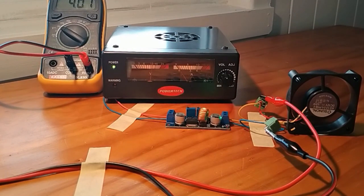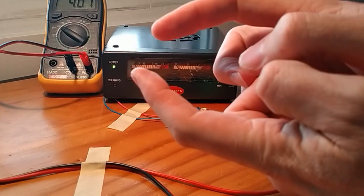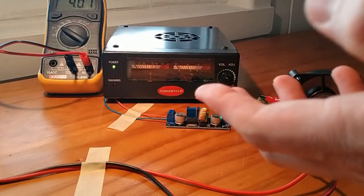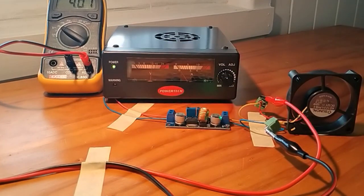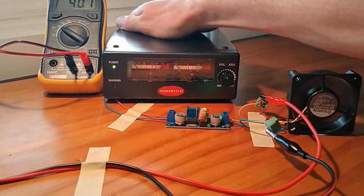Okay, so now what we need to do is set the current. The reason that we're setting the current is, should the two wires, or your workpiece and the actual gun, touch, you can short the circuit out. You'll throw too much voltage or too much amperage in there, and that module will destroy itself. So this next feature here is to turn to limit the current.